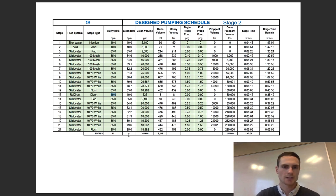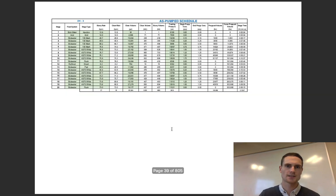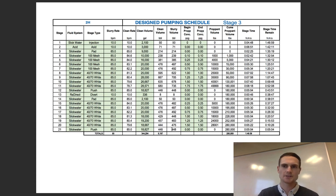Once their treatment is over, they're going to ramp concentration back up to 1.5 pounds per gallon and then shut it down. After about an hour and 45 minutes, they'll be bringing the stage down, pumping their flush again — 452 barrels — to make sure that wellbore is clean. You don't want sand in your wellbore when the wireline crew pumps down to set the plug on the next stage. After the flush they shut down and wait for the wireline crew to set the plug and perforate stage three, which should look pretty similar.